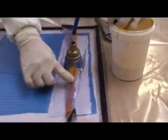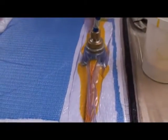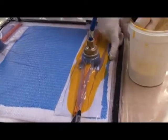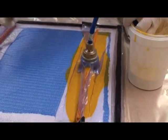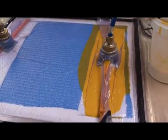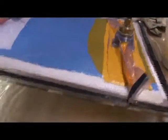So the resin is drawn in through the tubes, and you can see it filling up our breather membrane. Notice it's going backwards, away from the vacuum as well as towards it, and you can now see the resin front moving through the transport mesh. If we lift up, you can see underneath that the resin is moving through both sides.